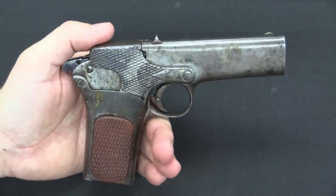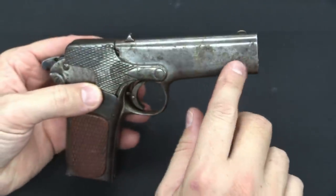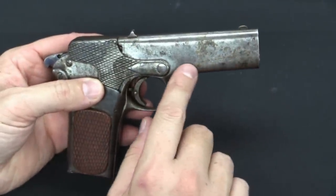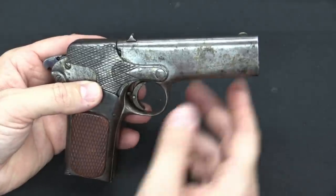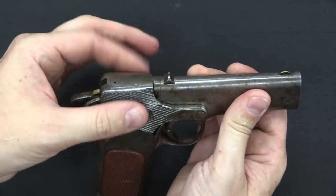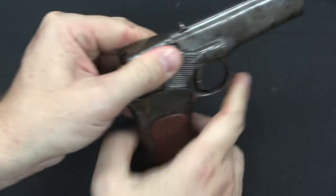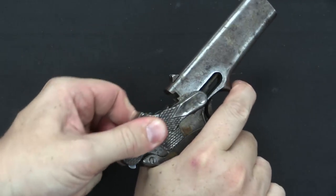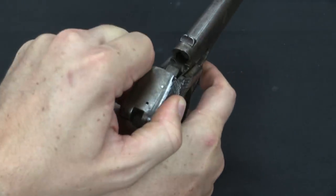This is clearly someone's shop experiment prototype gun. This screw contains a guide rod and a recoil spring inside a channel underneath the barrel. The breech block is this whole component, which pivots backwards. It's a fairly strong recoil spring — it pivots backwards like this.